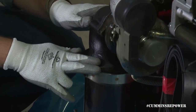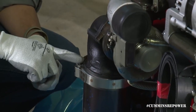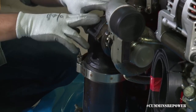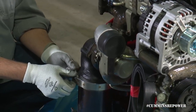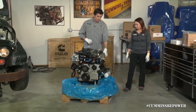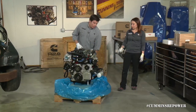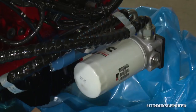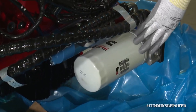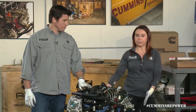Other things you'll notice that you may need to remove during installation and put back on after the engine is set in the frame rails is this engine-mounted diesel oxidation catalyst. You've got a couple of cap screws you can reference in the installation guide, or you can take it apart at the V-band clamp. Another component you'll probably move around during installation is the remote-mount oil filter — that is not the permanent location. It's supposed to get installed on the chassis; it just comes on the engine for shipping.